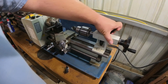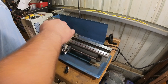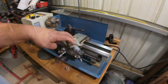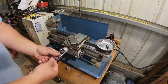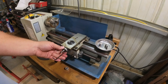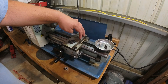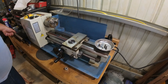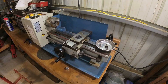So right off the bat, the first thing the instructions want us to do is remove the tailstock. I'm also going to remove the tooling and anything in the chuck to get that out of the way, so we have the best possible access to the cross slide and the saddle. From here, there are a couple of mounting bolts that hold the compound rest to the saddle — it wants us to remove that. I'm going to back this out and pull the handle and dial off. Then I'll take out the two socket head cap screws to remove the positive stop and unthread the lead screw. Next I'm going to loosen up the gibs — the gibs are basically what hold the dovetail, because the dovetails are on an angle, and that's what holds this side to side in place, keeping it rigid and maintaining a constant solid position. So I'll loosen the gibs and then slide it off the saddle.